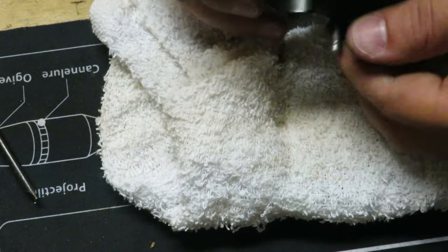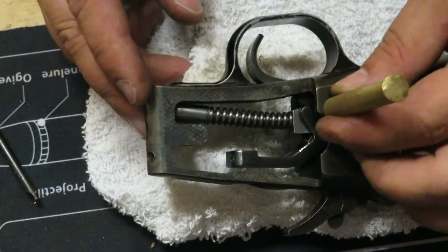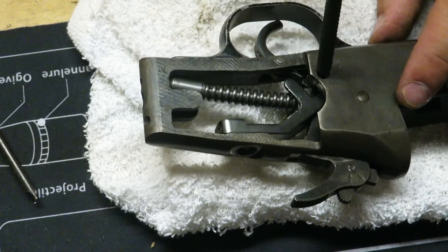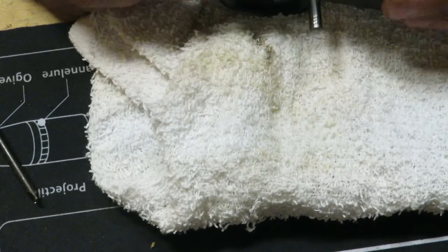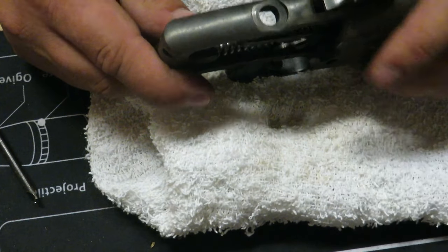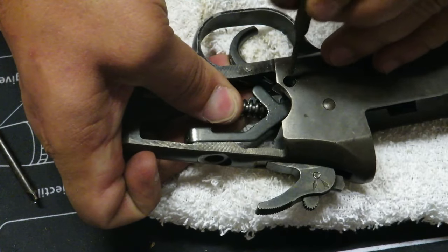Our pin is there, we're almost out. Get a little bit longer punch and finish that out. As you can see, as soon as it cleared it pushed forward — that's why I'm saying have that punch still in place, that way it holds everything and doesn't shoot all over the place. Now that pin is out far enough, work this out like such — this is your hammer pin. Pull back a little bit on the spring and pull your punch out.